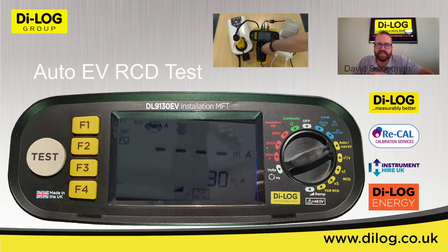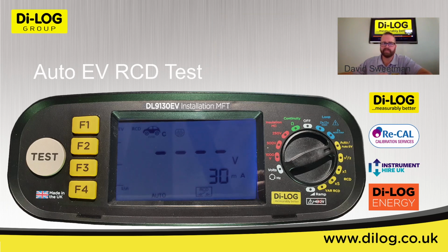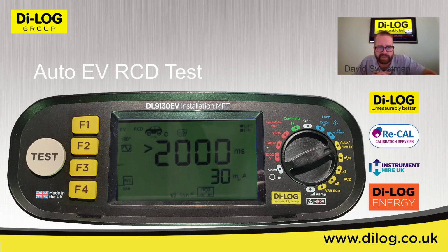There you go, the EV charger is reset. I'm switching it from control pilot A back to position C. And it will conduct the final test at 24 milliamps on that as well. Okay, and that's the sequence complete. So what you'll see is that pressing function 3, I can then recall all them results individually.